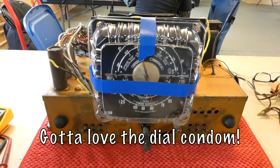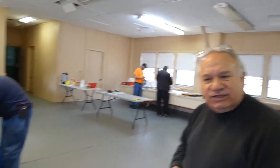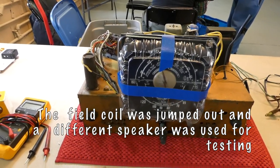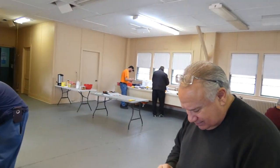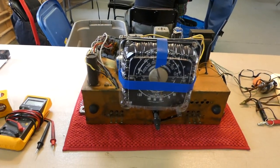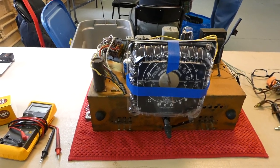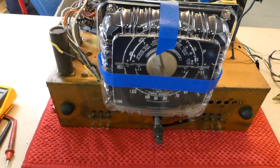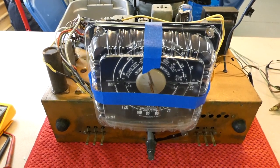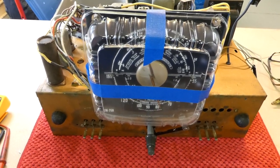Here's the radio I worked on today — it's a 10H 571. We had a temporary speaker set up in here, and Len had this thing, took it home, played it for about 20 minutes, and it gave up the ghost. I started going through things and couldn't find anything weird or burned up. Ultimately it was the speaker, because it's a field coil speaker. So I've disconnected the resistors to bypass the field coil, and Len's going to bring this home and put the original speaker back in.